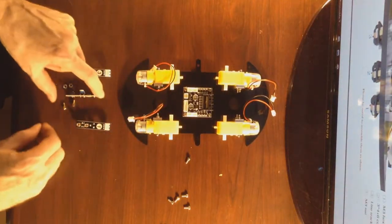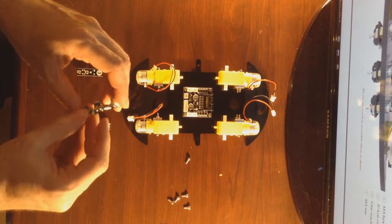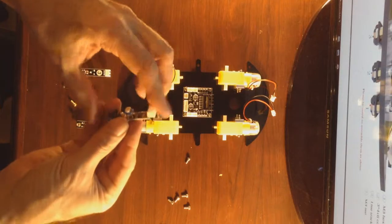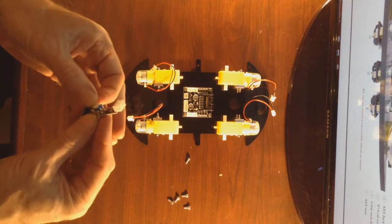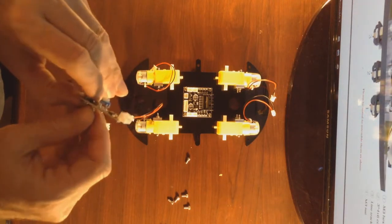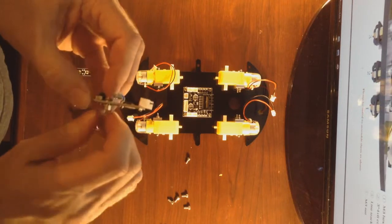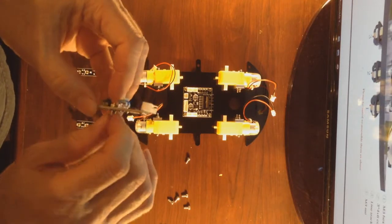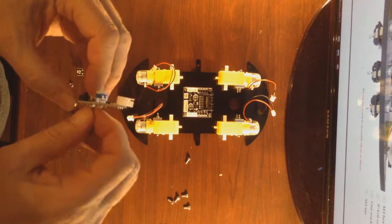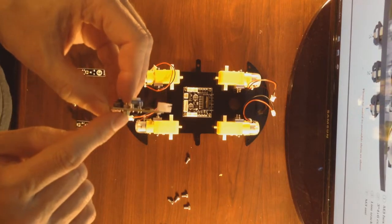Note that these brass colored standoffs go on this side of the circuit board and the nuts on the component side of the circuit board. Once these standoffs are installed, 2 nut drivers, a nut driver and a wrench, or a socket and a wrench, or a combination of the above, should be used to just snugly tighten the nut onto the brass standoff.